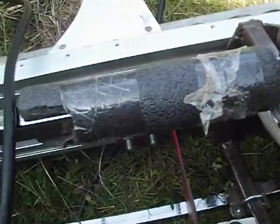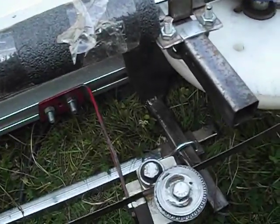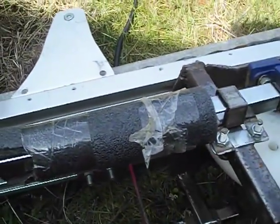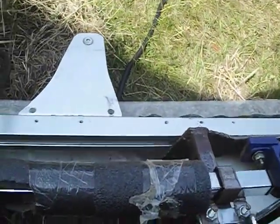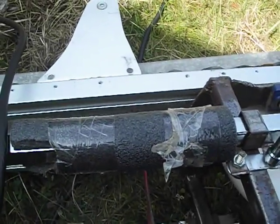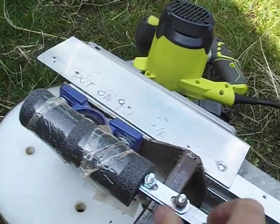This part here is in a little enclosure sort of thing rather than fixed, because as you adjust the tension, this is going to move back and forth a bit. You can also put on different length bands — I had up to 93-inch bands on it originally, now I'm using 86 or 85 or something — a custom length. To adjust these, you just loosen a bolt and move it up or down, on each end and on both the front and the back.